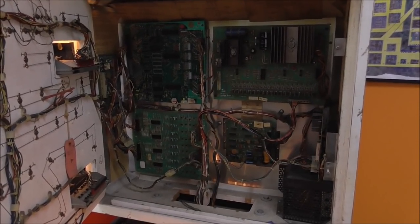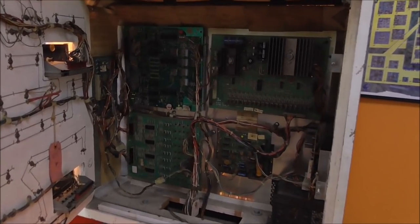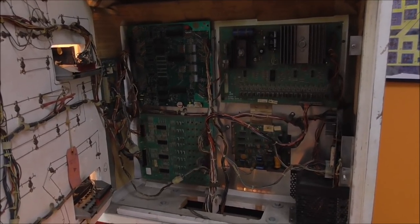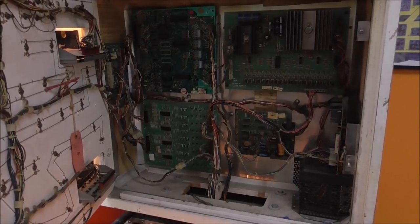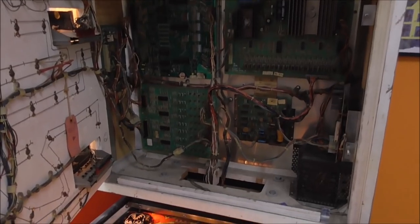They only have 6 flashes. They don't do 7. So their flash sequence is a little bit different, but the flashes mean pretty much the same thing on any of the games, because it's basically the BIOS part of the ROM doing some tests right when it comes up.